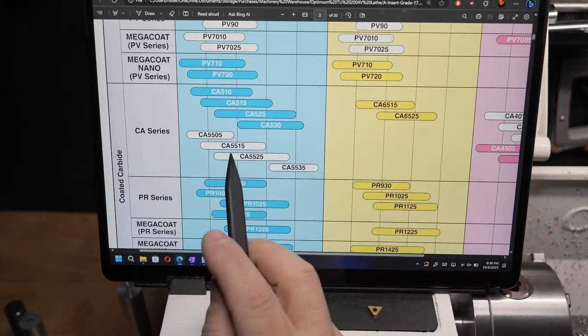I always knew that you should have it slow so that the cutting tip, which is rounded, overlaps the previous cut as it goes across and doesn't end up cutting like an Edison cylinder recorder, where it cuts a spiral on a cylinder. You don't want that. You want the spirals to be so close that they even overlap to give you as smooth a finish as possible. They give you a value that it should be at, and they're saying that the infeed speed, which we know is 0.11, should not exceed half the corner radius.